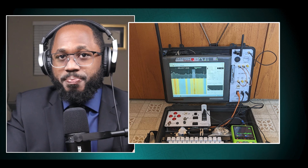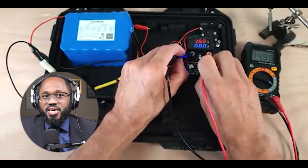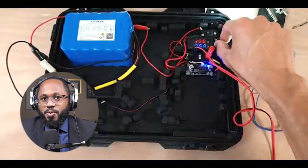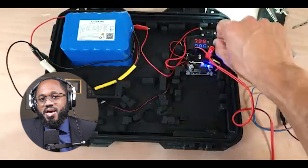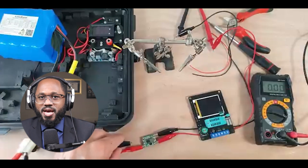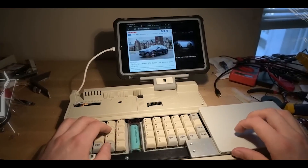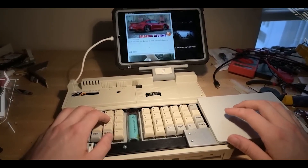Add any additional components like USB hubs for extra ports, audio components like speakers and headphone jack, additional storage, or specialty modules like software-defined radio. Then design the internal layout, arrange components to fit efficiently in your chosen case, assemble the hardware, and install your operating system. Linux distributions are popular for cyber decks. Configure your software and test all functions. The key is to start with a basic functional design and then customize and expand as desired.